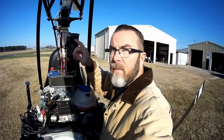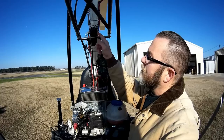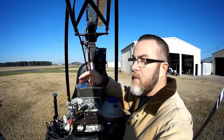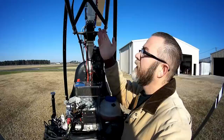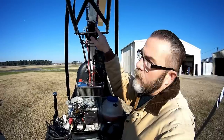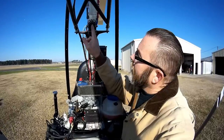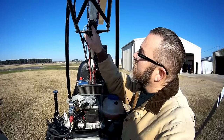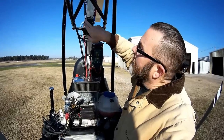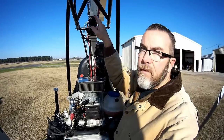So the way we get around that is we stick another starter solenoid right here. And this is just a typical Ford starter solenoid from, I don't know, I'll just pick a random number, a 1985 Ford Escort, whatever, and there you go. Anyway, stick a welding rod in between as a large resistor. And when you have it on low, this is not tripped, so the power to the starter, this solenoid will trip, making the starter turn, but it has to draw its power through the resistor that we made.